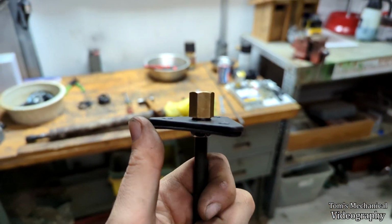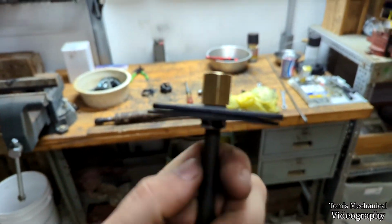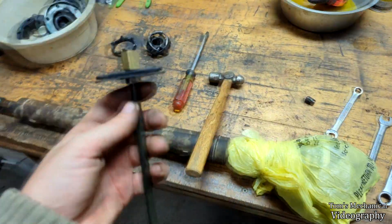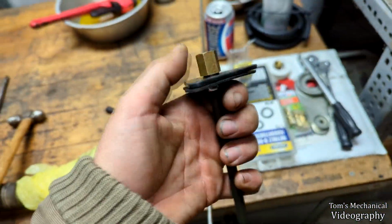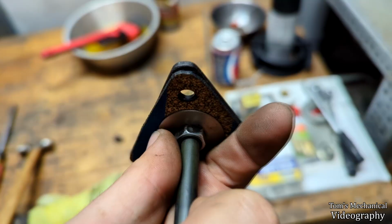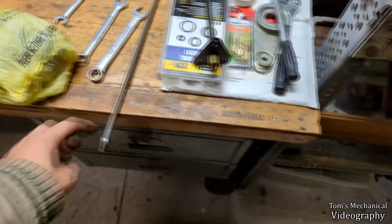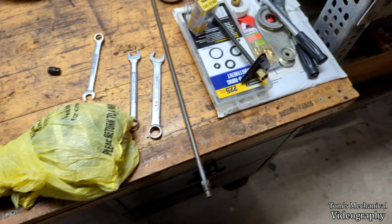All right, so apart from the drill press refusing to actually stay concentric on the thing, so the thing not being flush, and me taking an extra 1/16 of an inch off to make sure I could bottom the thing out, it's perfect. Because it's sealing in here anyway, so this seal is only as good as cork on washer is, and then this seal is brass press fit steel. So all we got to do is just bend this into a pickup, bolt it on, and that's it.